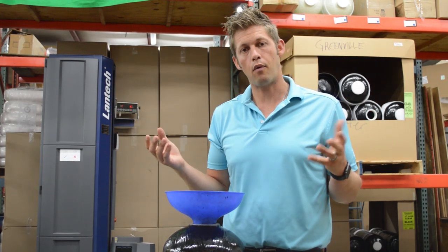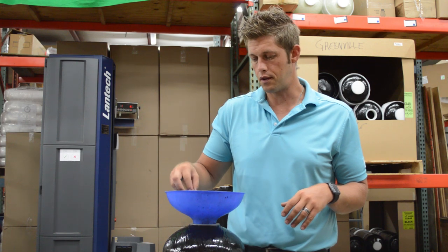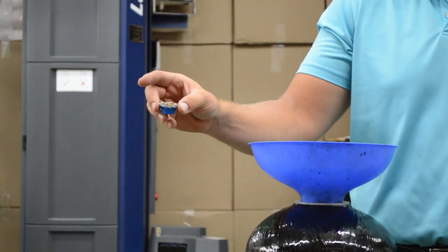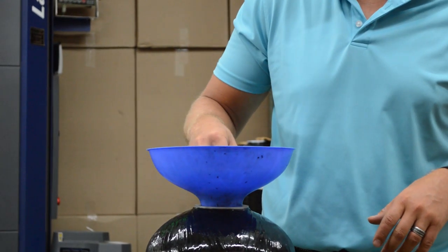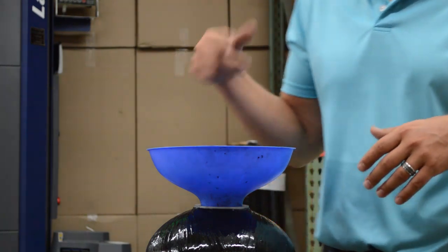The gravel also allows for better backwash, more even backwash, and better flows during service. Now you can see I've got my plug here — it's got a little bit of gravel left in it. What I typically do is pull that out, pour that down into the tank, then reinsert my cap. If you're using duct tape, you're not going to have that recess in there, so you won't have to clean anything off.